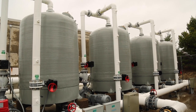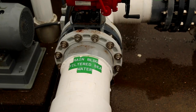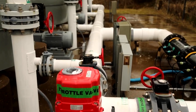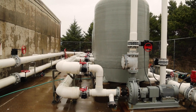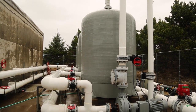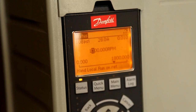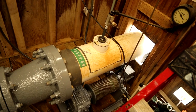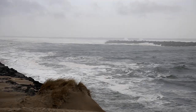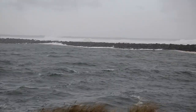At our seawater storage, we have the capability of filtering water at a full 1,000 gallons a minute to the building. Our intake system is capable of maintaining that 1,000 gallons a minute to storage. We can run that filtering system all the way down to 70 gallons per minute if needed, and up to 1,000 gallons a minute for service during the morning hours. The system is monitored by a computer control system that monitors the salinity and temperature of the waters, and automatically manages parameters for us. During low tides at night and high tides during the day, we can either divert the water or use it as needed.